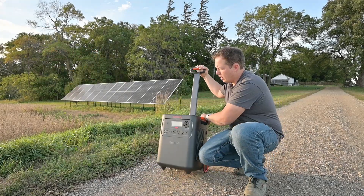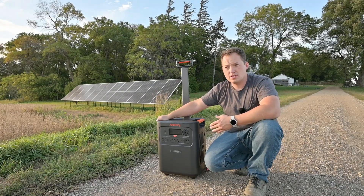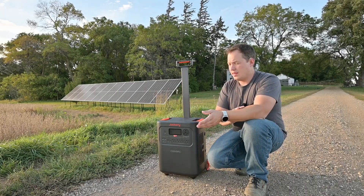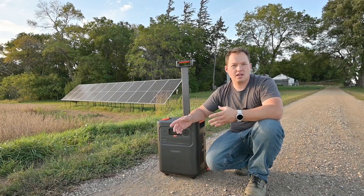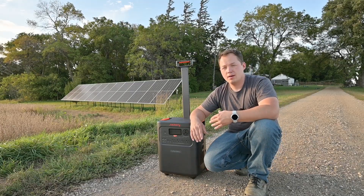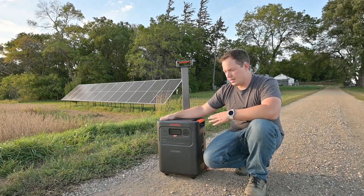Back to our output capacity — 3600 watts. This isn't large enough to power your whole house. If you use a generator inlet box and try to power your whole panel, you're only going to really be able to power half of it unless you get creative with some adapters. Obviously any of your 240-volt loads you will not be able to power with a single unit by itself.